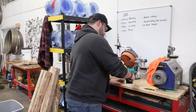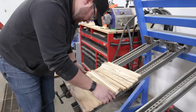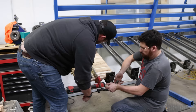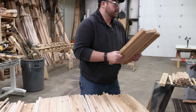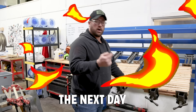We got this nifty little spreader, should make quick work of this. So Lou and I are going to lay these out, roll some glue. Our goal here is to build 24 inch wide panels. All the panels are dry now. We need to flatten them on each side, so to the planer.